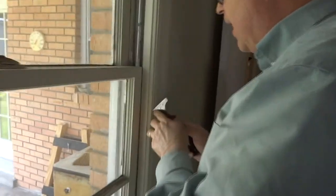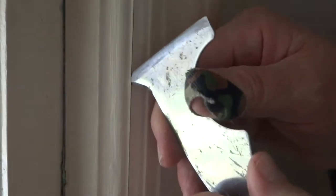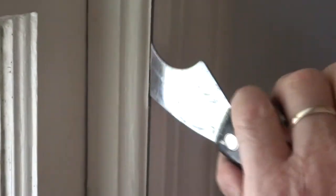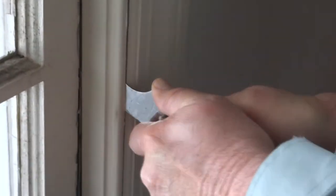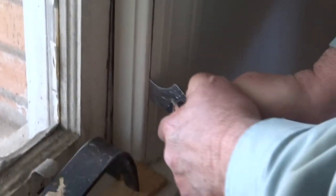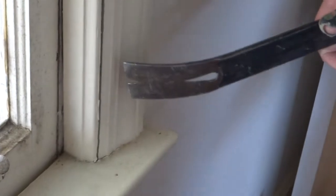I'm going to start where I see a crack. The painter's tool has a flat side and a beveled side. You want to go really, really slow — don't try to force it because it'll break. You do not want to have to cut trim again to fit the window; it just adds more time. So take your time and work it loose. Once he gets it open, he's got his shim and pry bar to protect the piece.